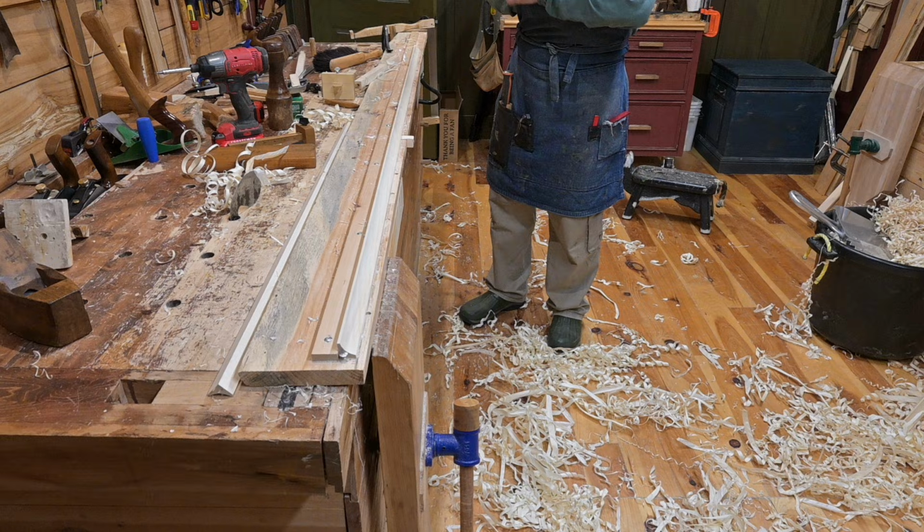This is a picture of Tom's trim making board holder, and you can see it's just a 1x8 with another piece of thinner wood screwed to it, and that is adjustable back and forth across the width of the board, down the entire length, of course, which in this case is about 9 feet, and this allows him to be able to unscrew that other little piece and move it back and forth depending on the size of the trim that he's going to make.